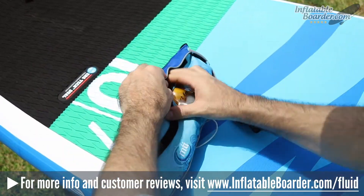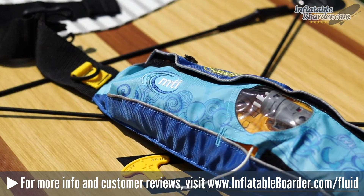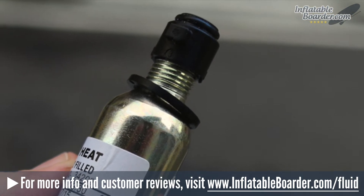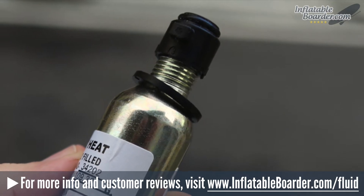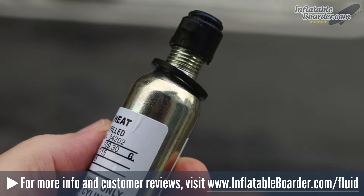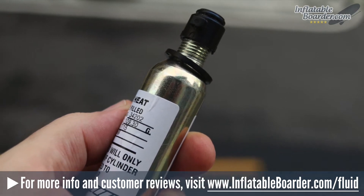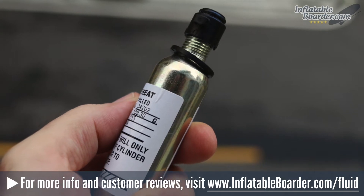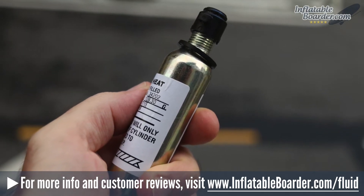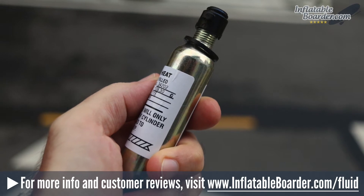Now let's talk about what we didn't like. We were honestly hard-pressed to find anything about the MTI Fluid 2.0 that we didn't like — this inflatable belt pack PFD is as good as they come — but there are a few very minor things to mention. First, we found the included bayonet style CO2 cartridge to be a bit fragile, and it's important not to break off the plastic ring around the top of the cartridge, as ours got broken prior to installing it. If the plastic ring does break, there's still a way to insert the cartridge, but the indicator won't turn green anymore. Secondly, the included CO2 cartridge is single-use, meaning once you've pulled the jerk cord, you'll need to purchase another CO2 cartridge — though this is a downside of inflatable belt pack PFDs in general, not specific to this product.